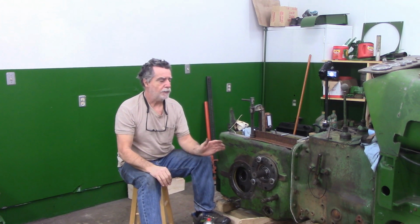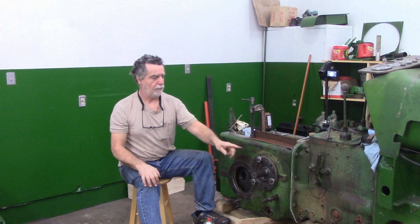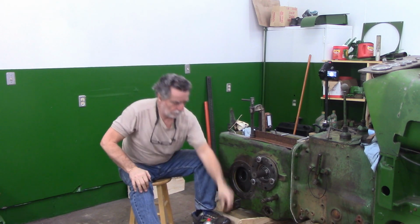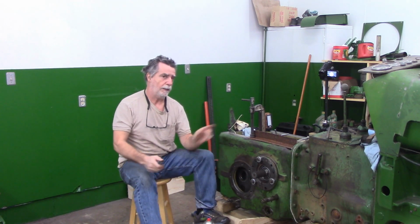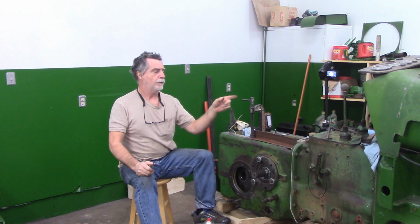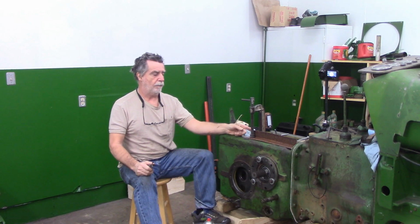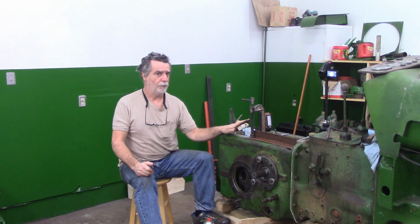Very quickly realized it wasn't that at all. Before I tightened the other side, I came back over here and loosened these bolts off on this side, and got my little screwdriver and backed it off ever so slightly, and then the crown gear was able to turn. So I snugged up the other side, still able to turn. Started to snug up this side slowly and I was not able to turn.